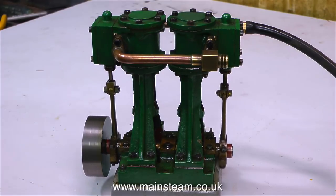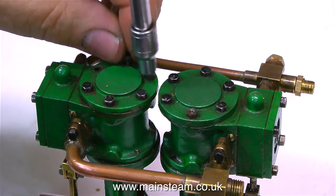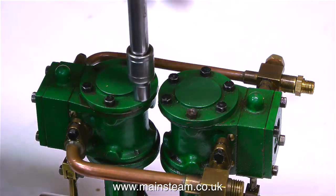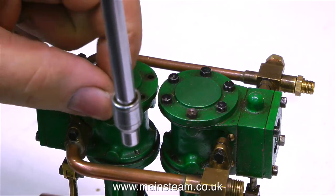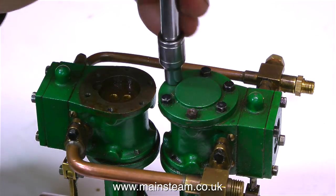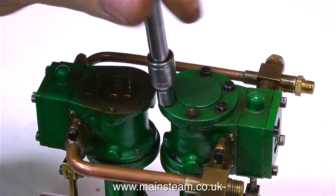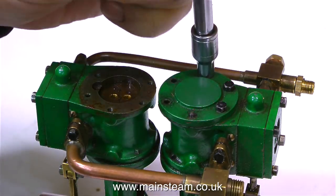But there's more to it than just putting piston rings in an engine. I never like to bodge anything — if a job's worth doing, it's worth doing properly. I will show you the piston ring job that I did. If you look at this, there's something wrong with it in my opinion, and I've come across this many times. If an engine is not very good, usually things like the nuts, cylinder head bolts and random parts are just painted in a different colour. Almost universally, the engine is not going to be good once you get it apart, and I don't know why it is, but it seems to be a fact.